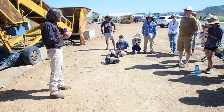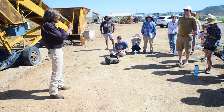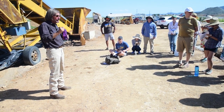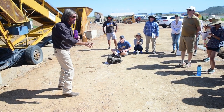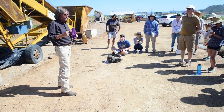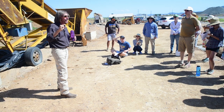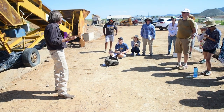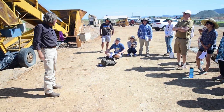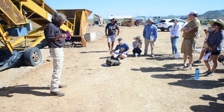You know, the stabilizer is the most expensive thing you put in the block. The dirt's cheap. The water's pretty cheap. Sand's cheap. It's the Portland and the lime that you go down and buy. They're the high embodied energy, manufactured, expensive product, okay? We're proud of the fact that we use very little, but we're using it. There are still, even after construction, even when you're done, some advantages to being stabilized, of course.